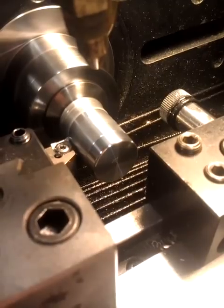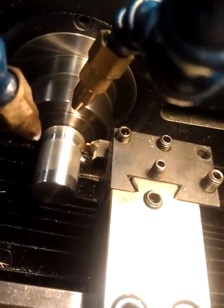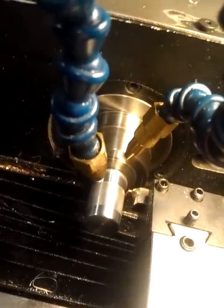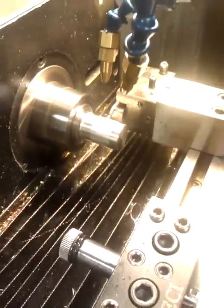Now I have a groove tool. I'm using this groove tool to do all the backside of the part so I can get in there. Just come in and kiss — taking off a light cut, doing a radius on the front lip, sliding across facing it off, putting a light little radius on the backside of that part, and she's all done.